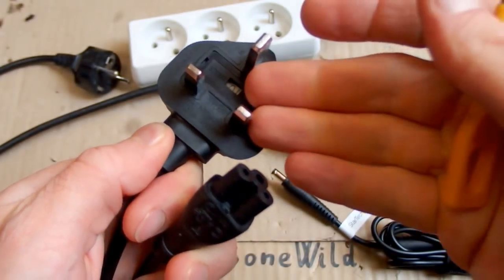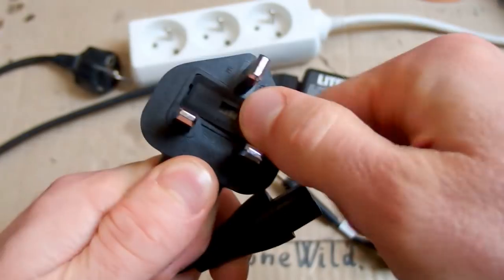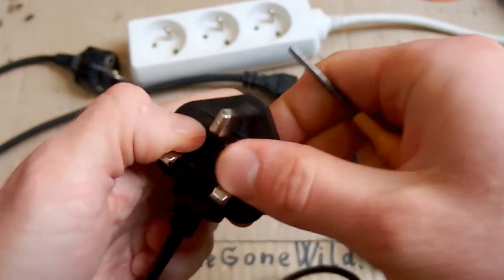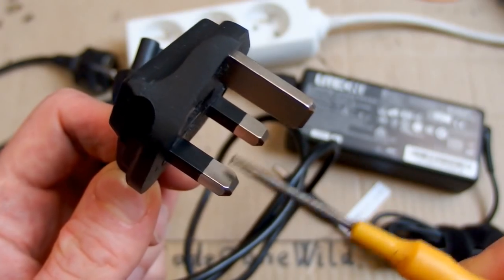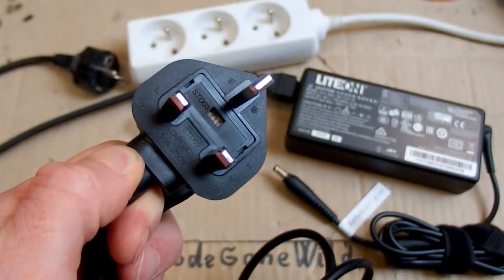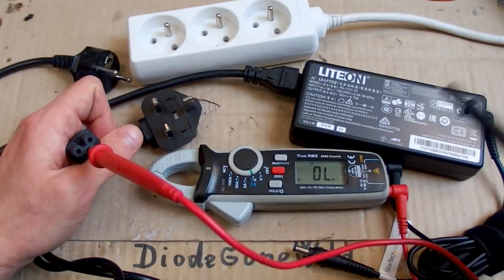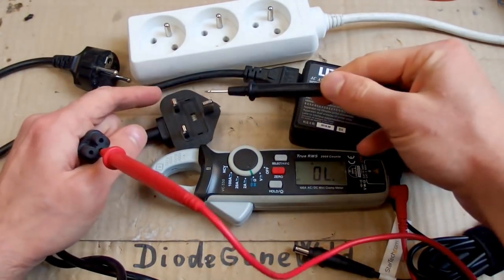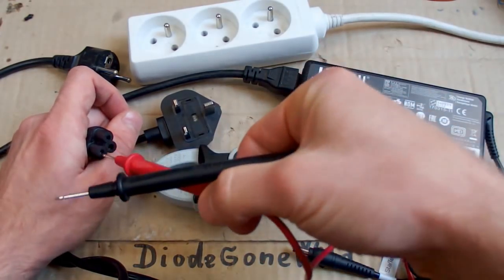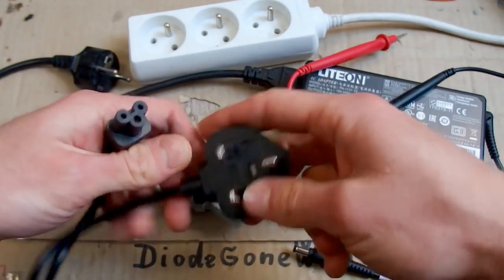Before this, let's quickly check the British plug. It has a fuse, because a proper British plug has to have one - a 10 amp fuse, lead-free. It has sleeved live and neutral pins and a non-sleeved ground/earth pin, so it seems to be compliant. And before opening the power supply, it's a good idea to check continuity of the cable. I can see continuity in all three terminals, so the cable is fine and the fuse as well.